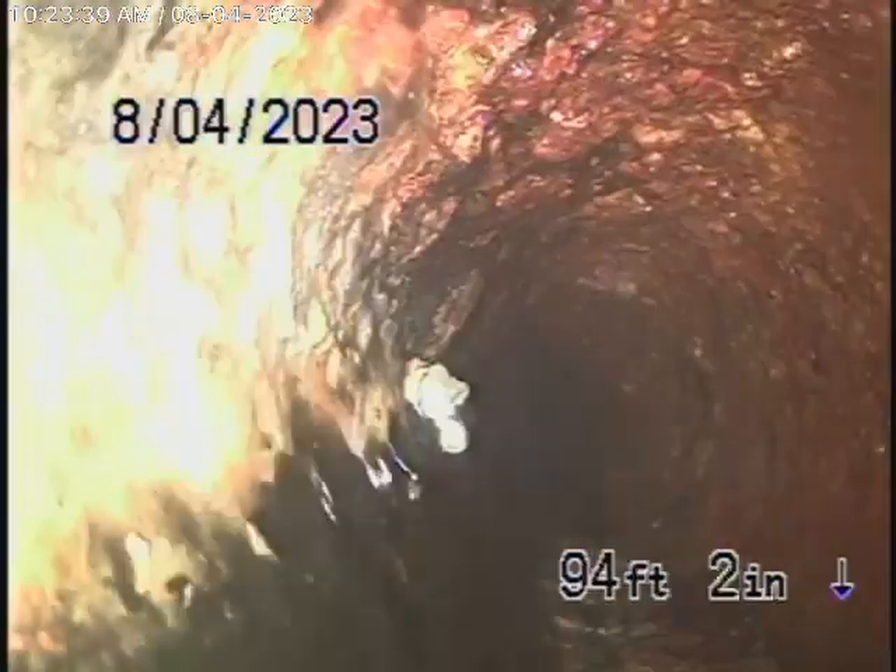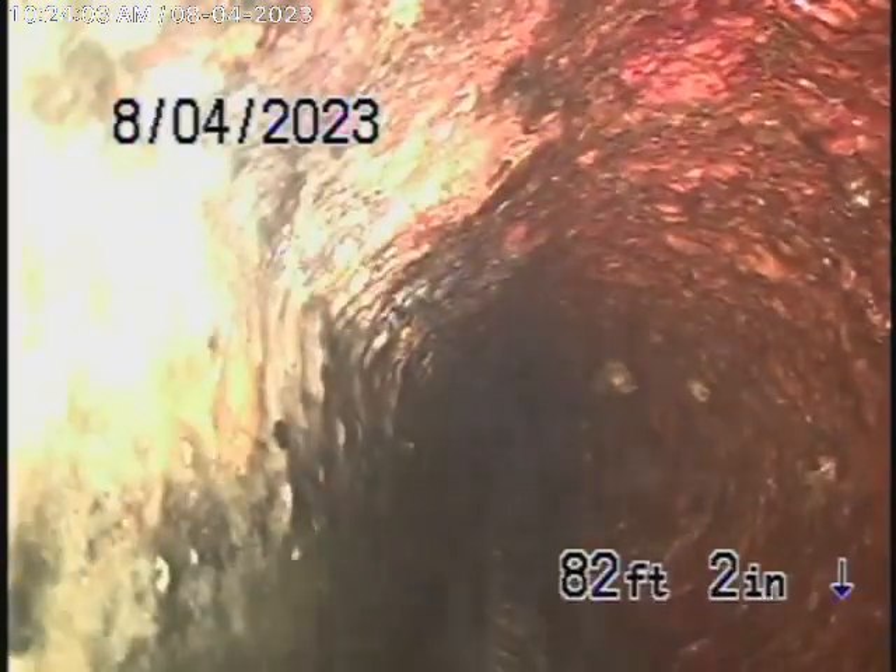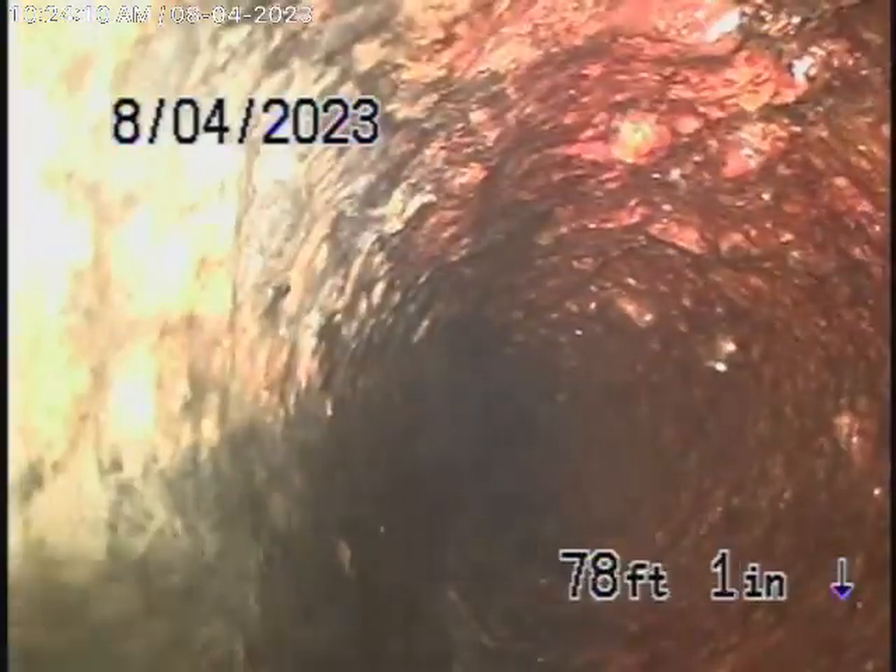I doubt very much that this has any effect on what's happening underneath the house in the back. What I think is probably happening is that the piece of cast iron underneath the house to the outside is leaking, and that's why it shows signs of dampness. The lady in the back said she hasn't had any problems with the sewer line, so it hasn't blocked up. You would probably have much more water underneath the house. The old cast iron pipe underneath the house was very badly cracked — a very old pipe.